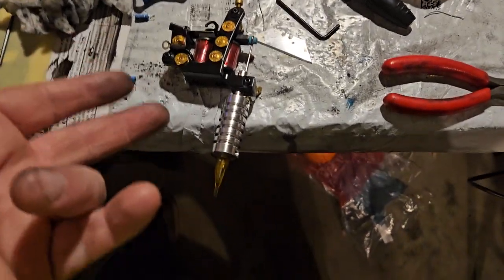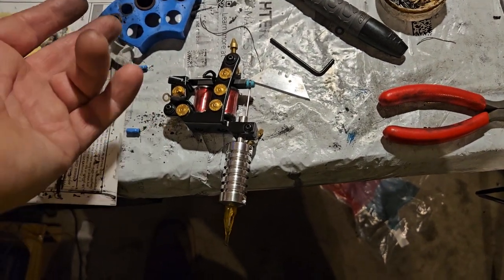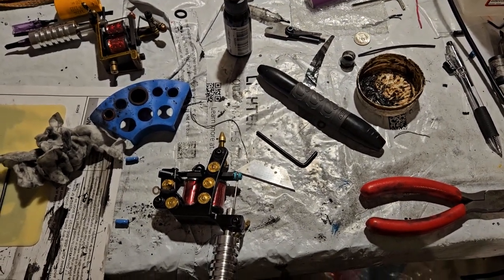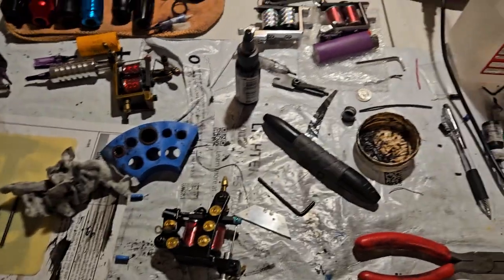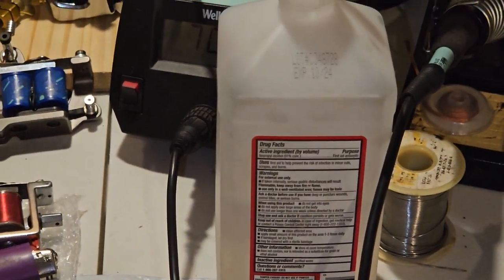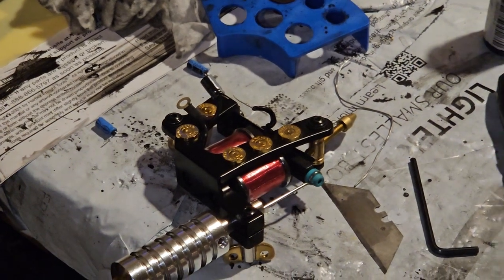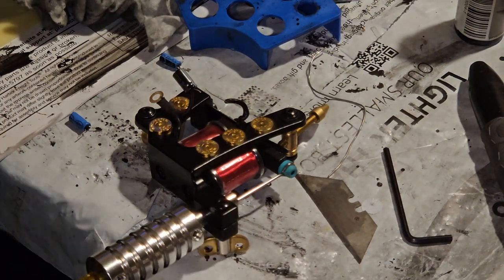This is a liner and it's not running fast enough. You pull the 47 out and it actually has a polarized one in there. I don't have any bipolar — otherwise known as non-polarized — capacitors on hand. Using the Weller iron is much easier than trying to do this with a soldering gun.